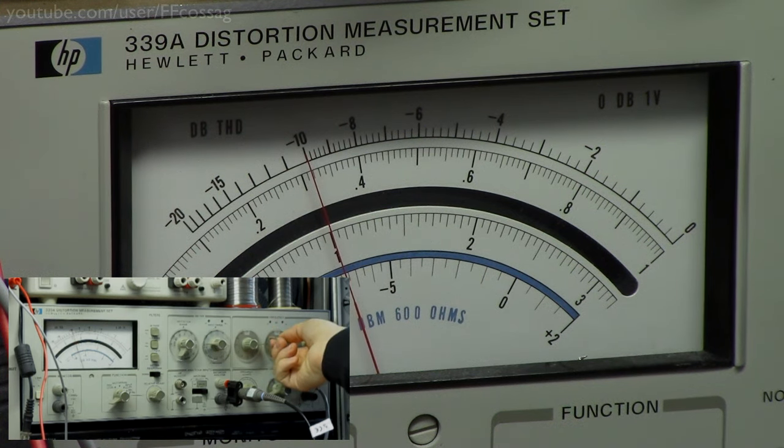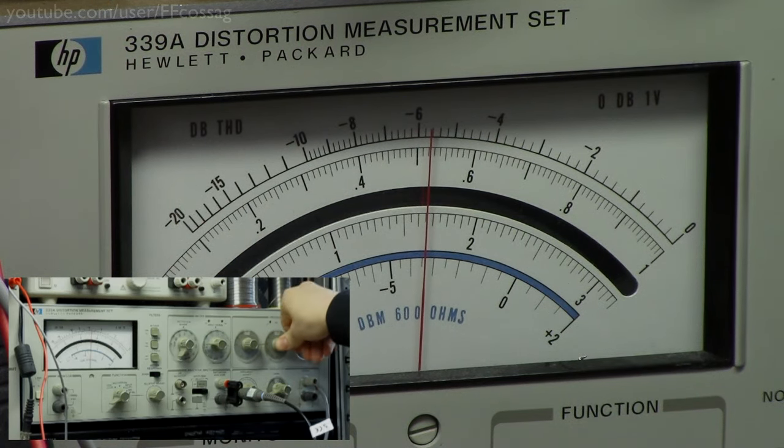290, and we're starting to get down a bit, 8 decibels. Yeah, so this isn't a very sharp filter, and it certainly isn't a very well-configured filter at that. So, that's a bit of a letdown. But at least there is a filter, you don't have to add an external filter, and indeed that would be impossible since you just have the two stereo inputs, you don't have a separate input for the subwoofer.